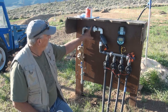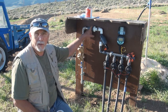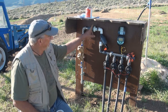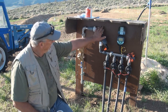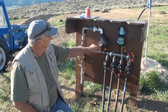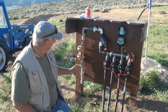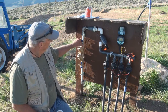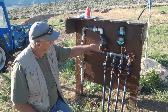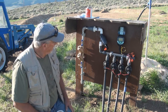It runs up through a pressure regulator that handles up to 120 pounds and reduces it to 30, so everything on this side in plastic is at 30 pounds. It then runs down through an 80-micron filter which I can vent: if I shut down the system I can unscrew it, take out the inside filter, clean it out, and put it back in service.